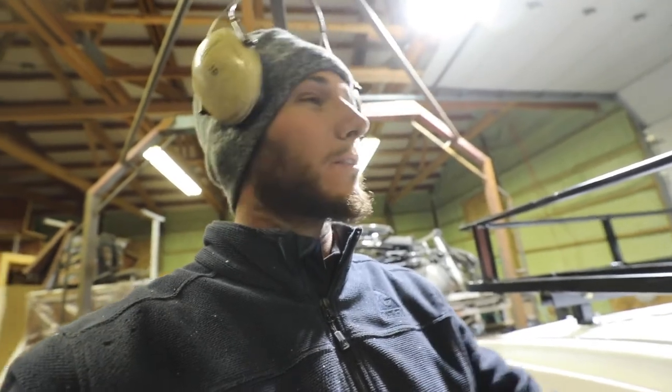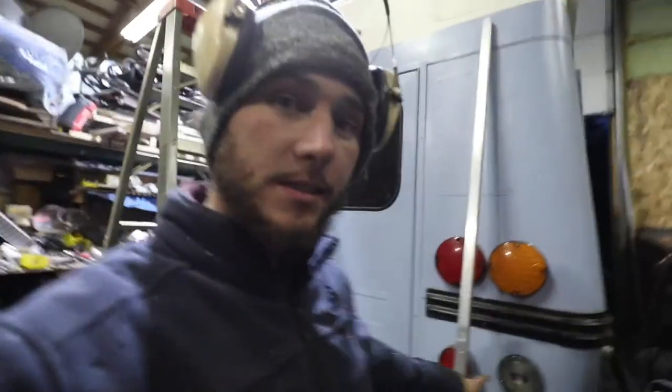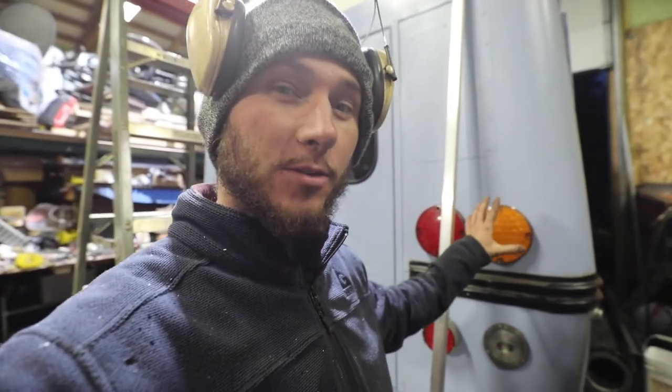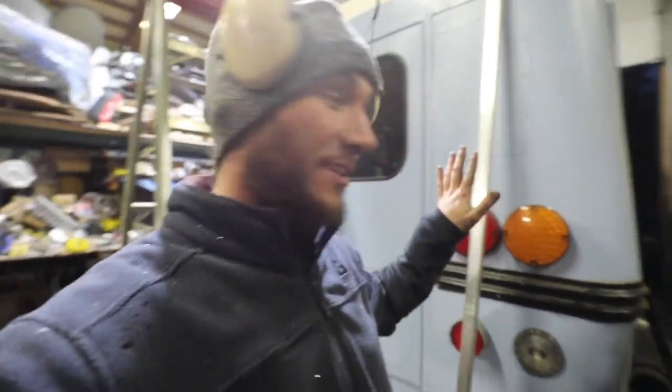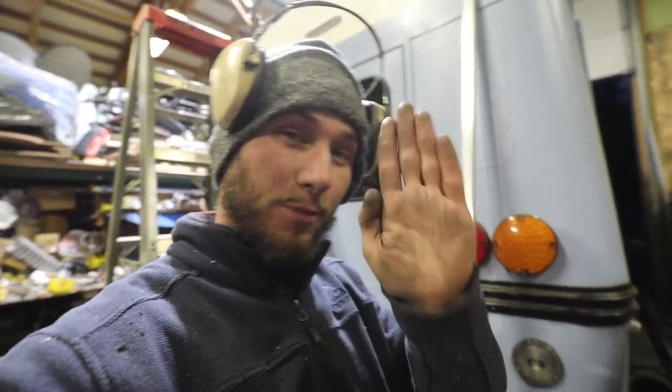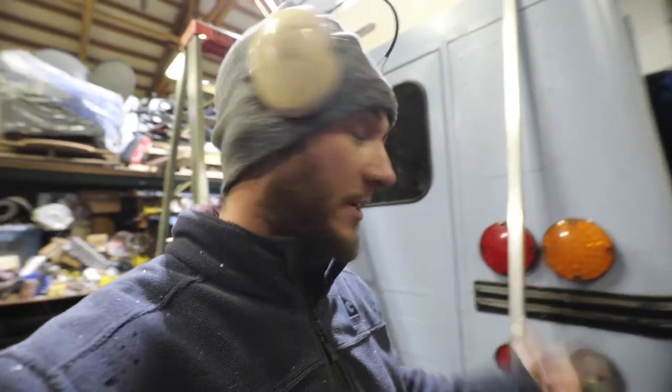We're gonna build a ladder coming down this back corner behind the door so that you can climb straight from the ground right up to the deck. Because there's these lights that stick off in the back corner, we've designed the ladder to have a little bit more space off the bus at the bottom than it does off the top. So that'll actually give it a little bit of a slant so that when you're climbing up and down, it's not a perfect upright ladder. It's gonna be slightly tipped, which will make it much easier to go up and down the ladder.